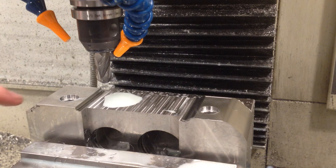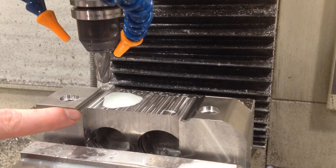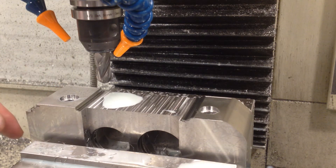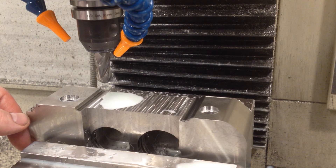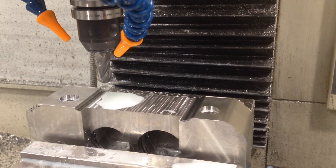The reason I stopped: when I did my 3D adaptive roughing, I think I should have went with a finer step. As you can see this is pretty rough, and it's leaving a lot of material for my ball mill. So I went ahead and ran this side and just slowed the feed rate down on the first couple cuts. I wanted to stop it and go back in — I'm learning Fusion — so I'm going to change it to where I take more away with the adaptive roughing so that the ball mill is not doing as much work. Right now that's the only ball mill I have; I want to keep it running and don't want to mess it up. So I'm going to go do that in the code and we'll see what happens.